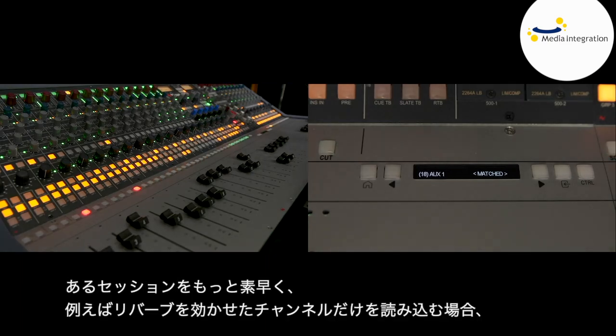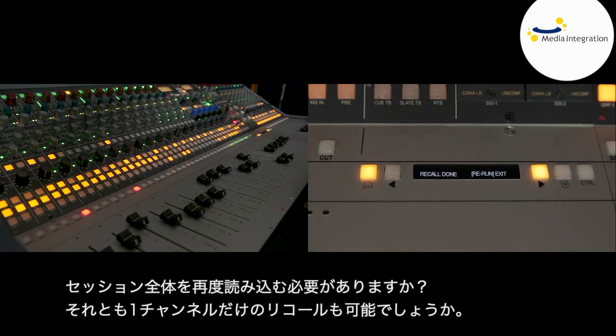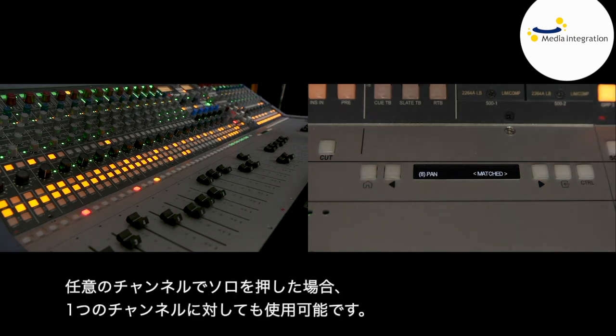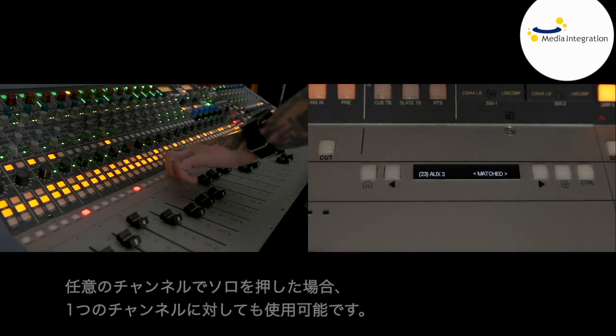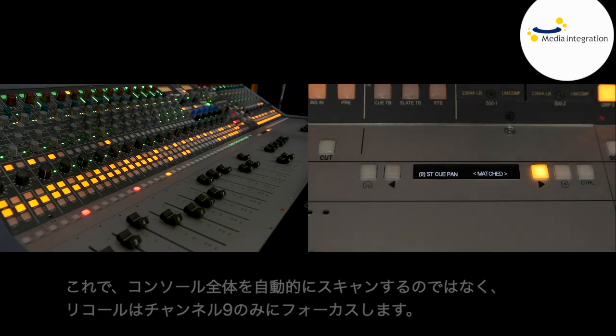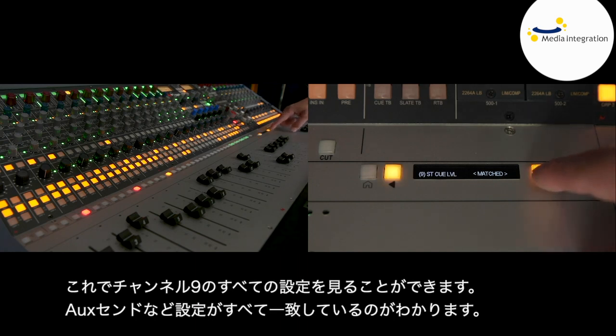Now, what if I just want to recall a session really quickly and dial in maybe a little bit more reverb? Do I have to load up the entire session again, or can I just load up one channel? So yes, you can use manual recall on a single channel. So if you press the solo on any channel, now you can see there that rather than automatically scanning the entire console, the recall is just focusing on channel 9. So it gives you all of my channel 9 settings, such as my aux sends. You can see that they're all matched there.